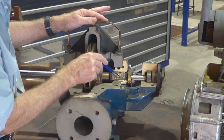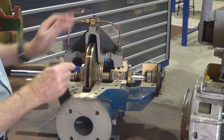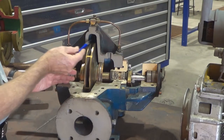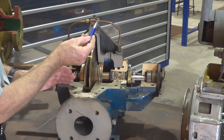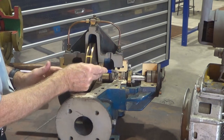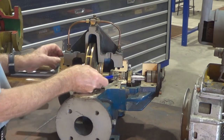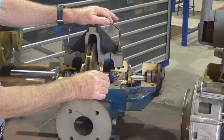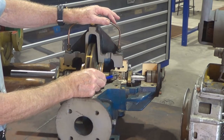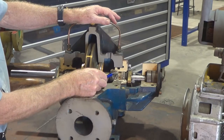That's a loose fit around the shaft and into the stuffing box. The purpose of the lantern ring is: as the pump rotates and expels the water, the high pressure is bled off down through there and by cavities down through the pump housing it reaches the lantern ring, and with the recesses and the holes that are in the lantern ring it allows the water to circulate around that.